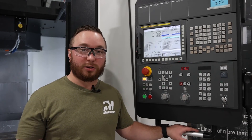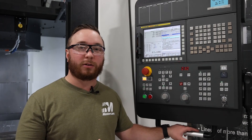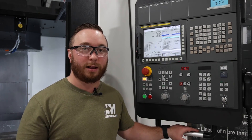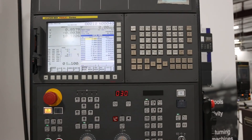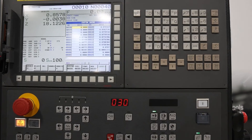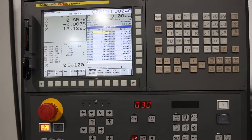The calibration ran flawlessly in the machine. The last thing I'm going to do is double-check to make sure that my macro variables were filled out for my calibration. On a FANUC I'm going to go to my custom macro offsets — I know that I'm using the 600s for my probe variables. Just by double-checking that, I know that my probe calibration was successful.